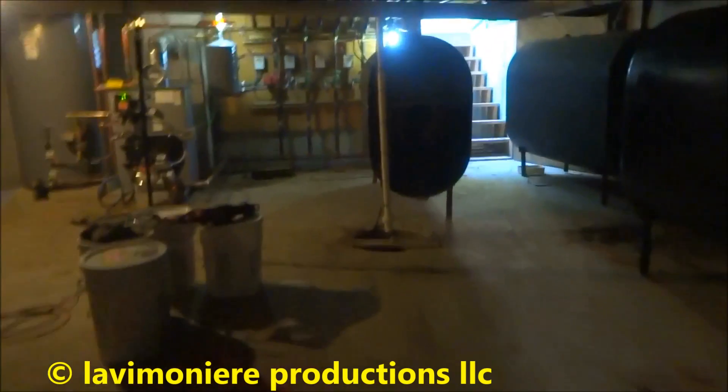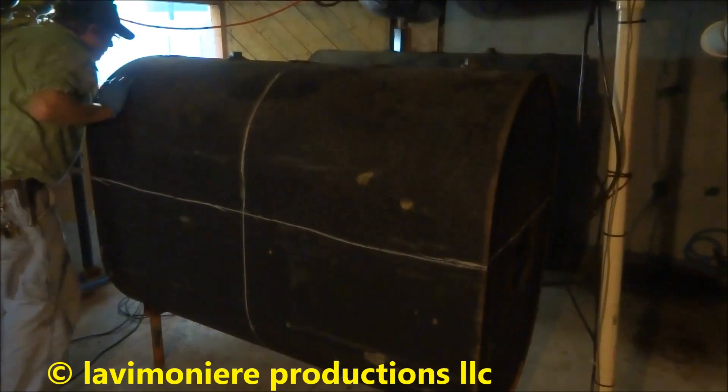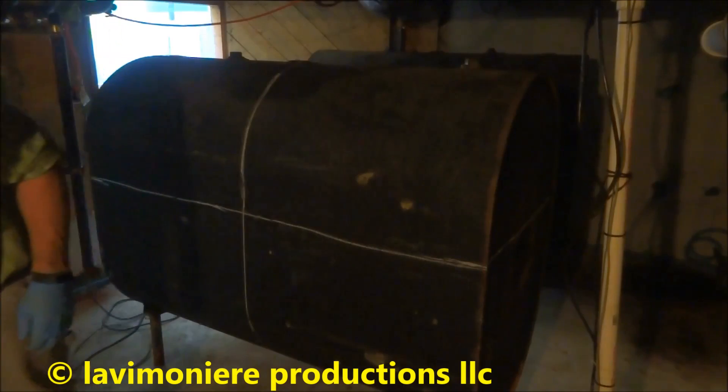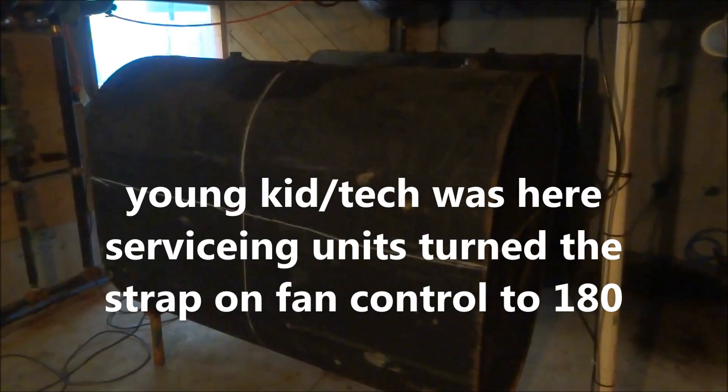All right, let me cut these tanks up. We've got no fans — well, you've got fans now, I just turned it up. The relay was set at 180. I'm going to show you — come on over here. The fan sensor was set at 180. That thing would never come on at 180. We turned it to 130, so when this pipe gets to 130 the fan will kick on. That was at 180 — who the hell would put that so high? That's crazy.